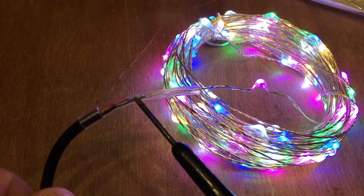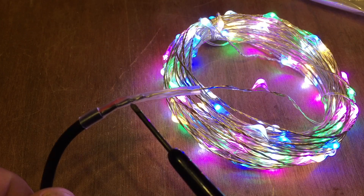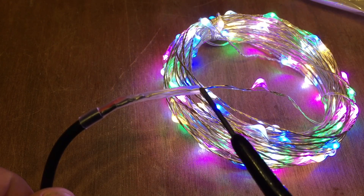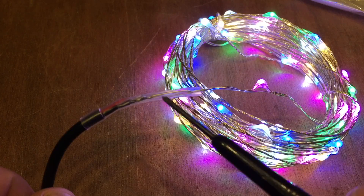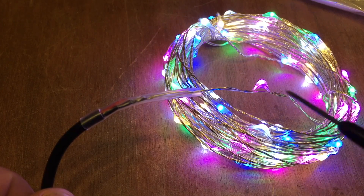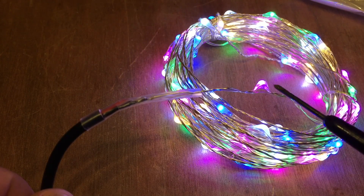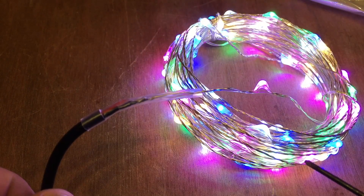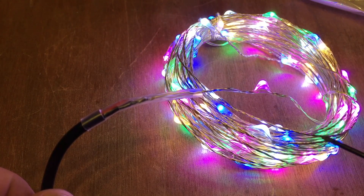This just seems to be the wires coming straight out of that 2.1, 5.5mm trailing lead onto the wires of the string of LEDs. So at 12 volts this must have at least four LEDs in series to ensure they're not going to draw too much current and blow themselves up. Hopefully they won't melt — they seem to be quite nice.